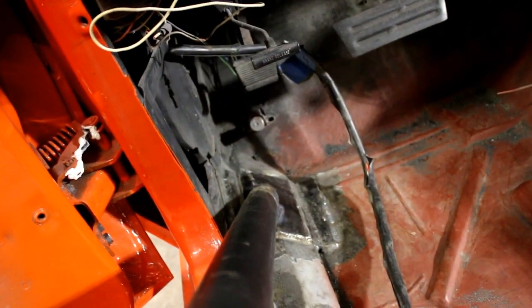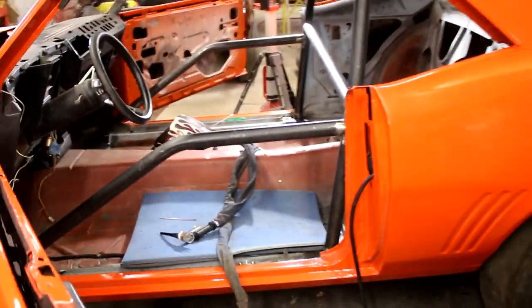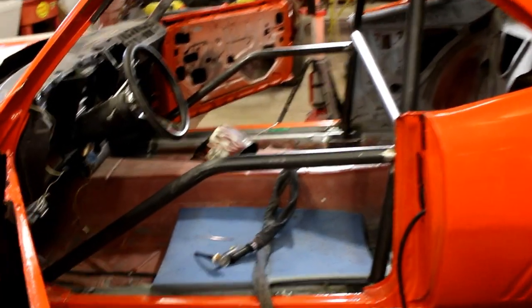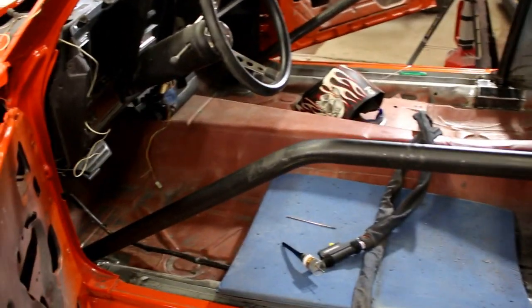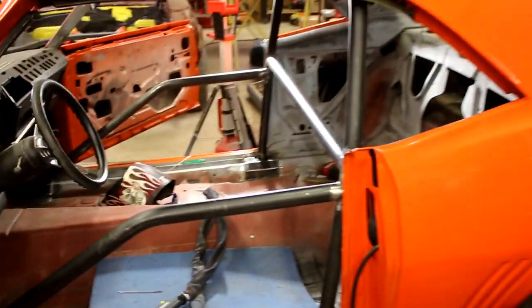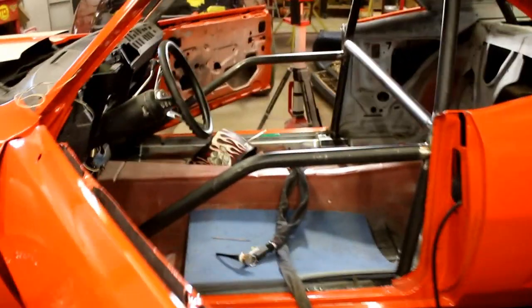The forward bars, same thing. You've got those huge plates I've welded in down there, and I've got to finish welding them, because it would be a nightmare to get into this car. I mean, look at this. This is going to be a driver, right? This is a car my buddy wants to take around, just drive and take to the track and be legal. So I am going to put swing outs on this. I've actually convinced him to do it. So I'm going to do a whole video just on swing outs and also some really cool TIG toys.